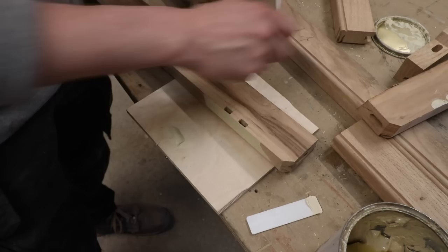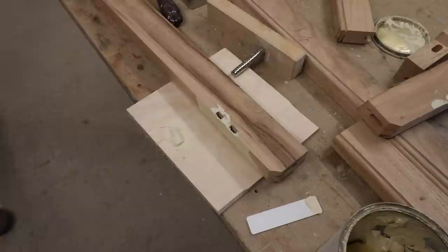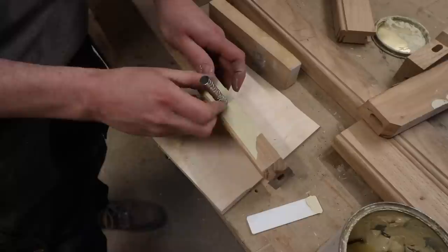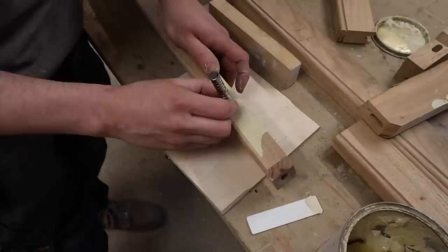Frame. Along that top there. We want to get that nicely in the bottom. I'm just checking here visually, but we want an even gap from the back of the piece of wood there to where the magnets sit, because we need to set an offset on that against the door. So got to be quite accurate with that, around 3 to 4 mil offset, so it pulls constantly while it's sat against the stop. So you don't want them all in different depths this way across the timber. They've got to be pretty accurate.